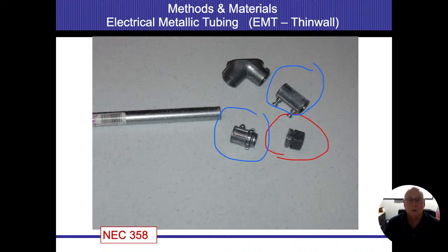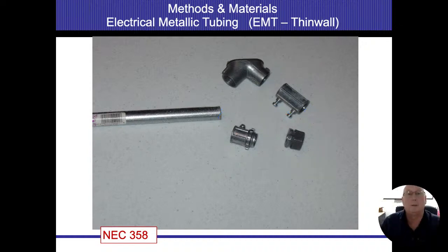For those that use thermal imagers inside the panels, I think it's a great idea. See which wires are hot. That could tell you if we're either overloading or have too much bundling, or if we have loose connections. Just a nice simple thing we could do. Doesn't have to be foolproof 100%.